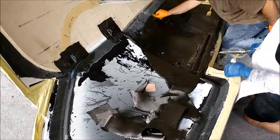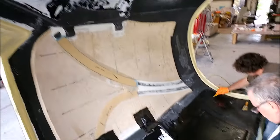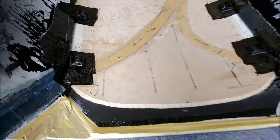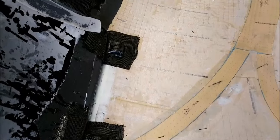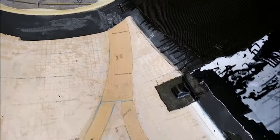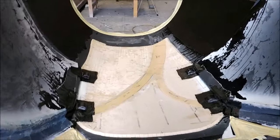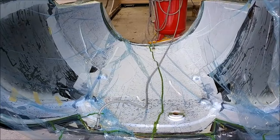Here we are laying up the second half of the upper fuselage. It's tipped up on the side again — Jeff is laying in the side bit and there's the center part with the extra bits of core laid in for where the parachute strap channel is. That came out really nice, clean and tidy, with a nice flat surface — we had five-eighths of an inch core and then quarter-inch over those straps.